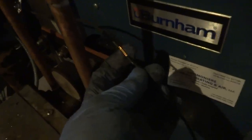So I did replace this. Oh, look at that. That's cooked. I gotta fix that. Look at the wires touching. It's no good. Gotta fix that, too. I guess it's thermostat wire. That's no good. Alright, so we got the thermostat wire out of the way now. Before it was laying in here, and it got cooked. So we should be ready to fire this thing up. I got everything purged. I just have to reinstate the heads. Just have to reinstate these three heads and I'm good.